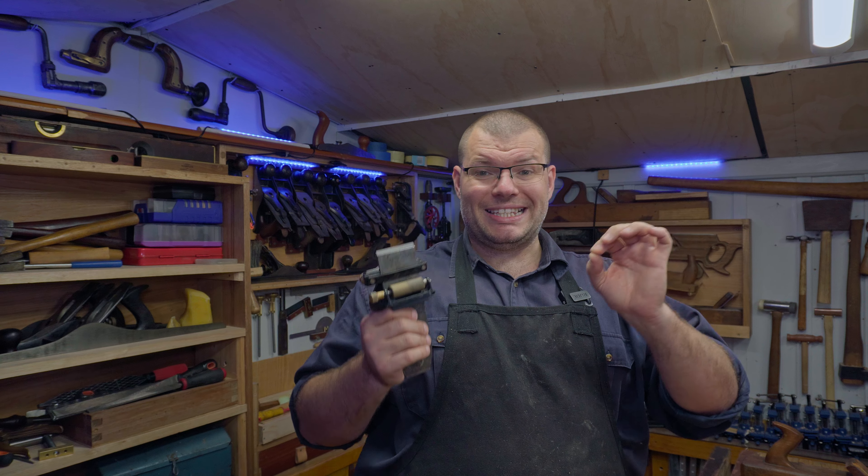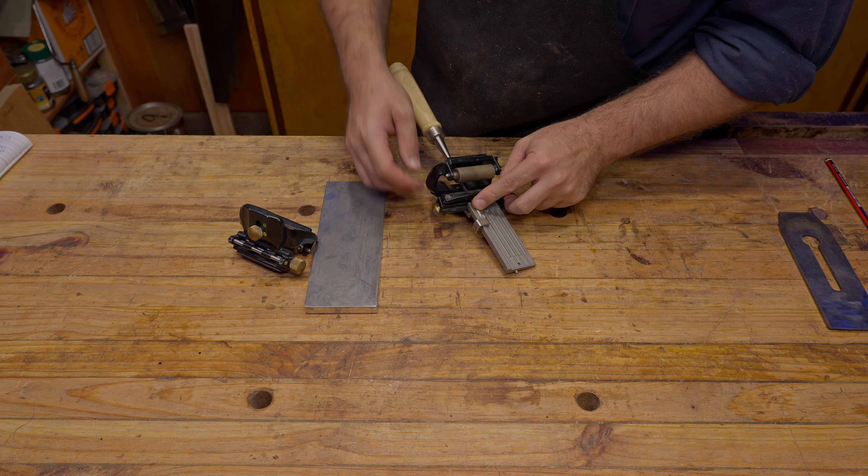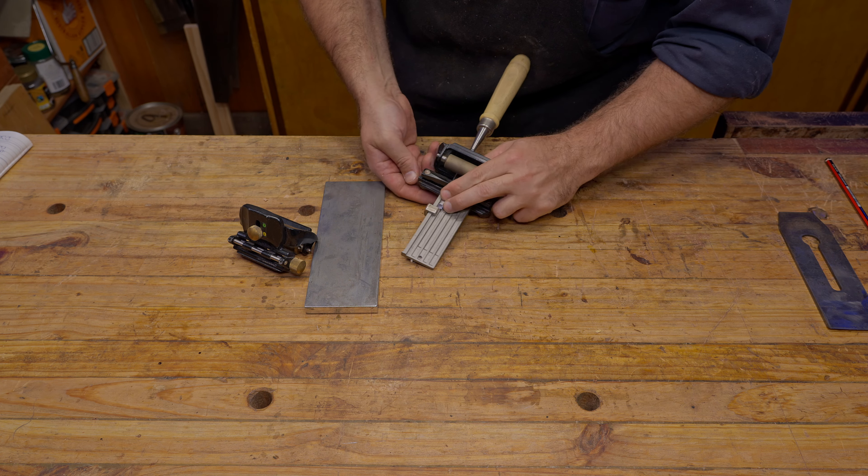Let's talk about narrow blades that are tapered. My chisel is the best demonstration of that, so that's what I'm going to show you. Always try to get your blade in the center when using these jaws — it's always going to work best and clamp best if you get it centered. That's just how they're designed, and it's necessary for even clamping pressure.